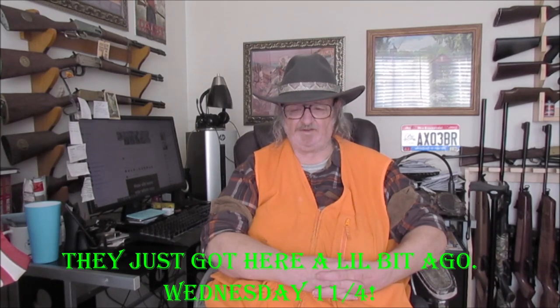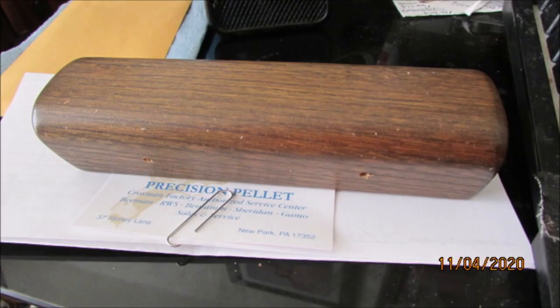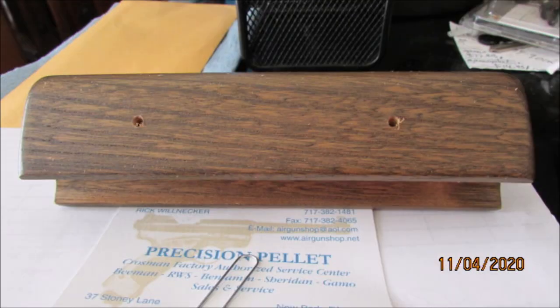Friday, the first set of parts is supposed to get here: the 761XL-style forestock that these things used after they ran out of the plastic ones that flaked apart, as you saw in a previous video. And the pump arm and the pins that hold the forestock to the pump arm. Here's the pump lever. The longest one is the elbow pin that goes in the hole right there, and the two pins that go through these little holes on this forestock, which is dark enough to match the tone of that plastic butt stock real nice, so I won't have to refinish it — just put some true oil on it.